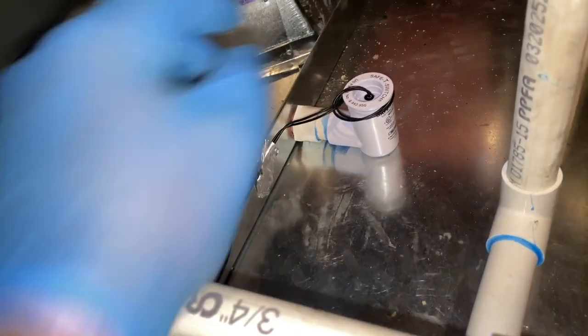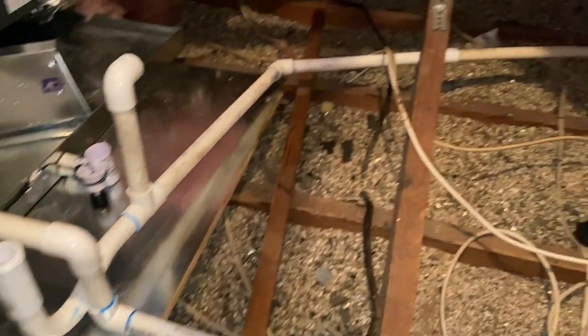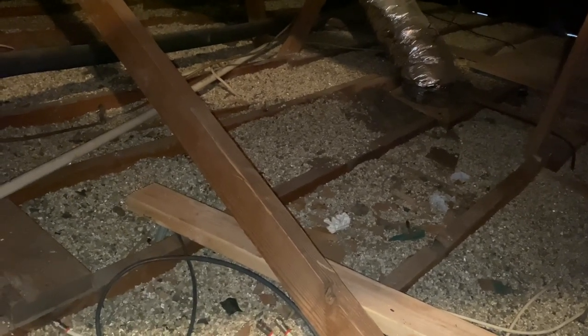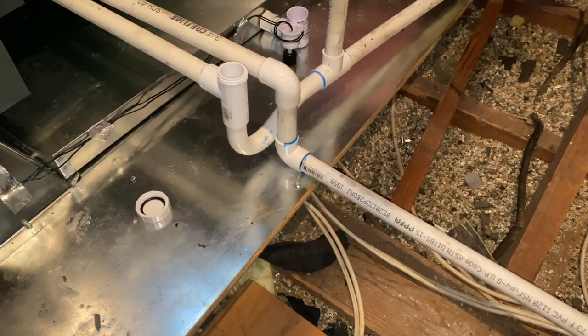If I do this it should just come right on. The primary drain looks like it might sag a little bit. What worries me is this is bone dry - I don't even think there's water in the trap. And then this is the secondary. I'm gonna get our PVC stuff and take a look at what's going on.